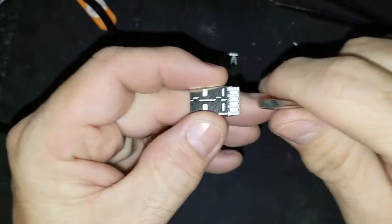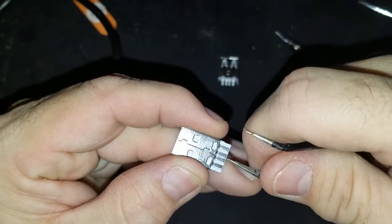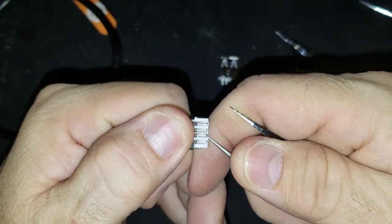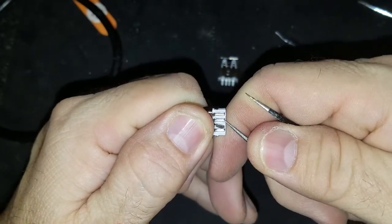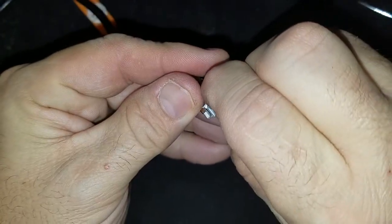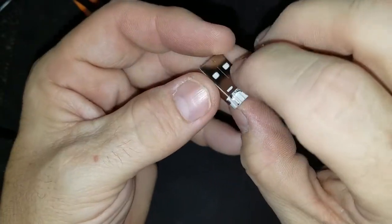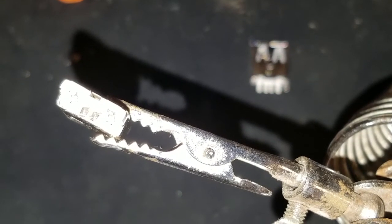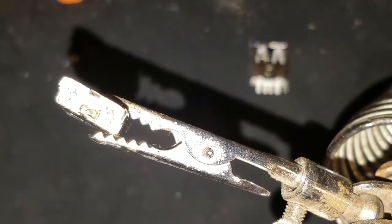The iron is firing up to temperature. I'm not sure we're in view here, so we can pry these two center pins up a little bit, and I'll go ahead and short them. Things are sharp — see that? Just raise them up a bit, and we're going to solder them together, or short them. Then we're going to clip the lead off as much as I can. Just like that. I'll get the helping hands over here. There we go — shorted. No big deal. Simple.